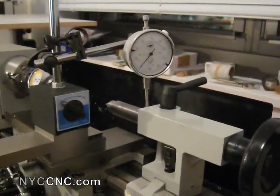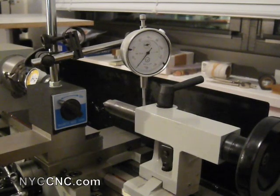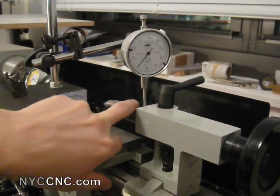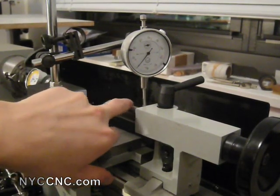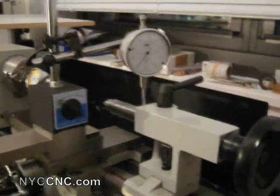What I've also done is move it off to the side a little. I know you're supposed to have it on the very top, but I would get gyration or variances in the reading from the marks of the length on the quill. So I've moved off to the side — I don't think that should be a problem.